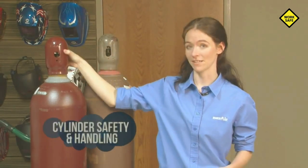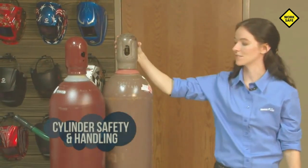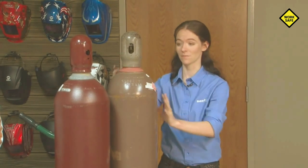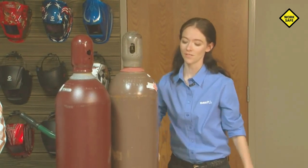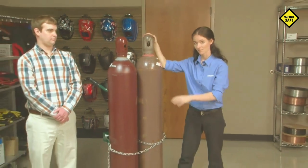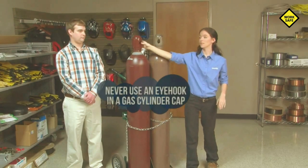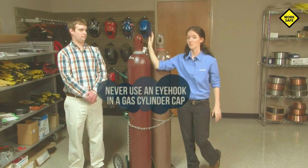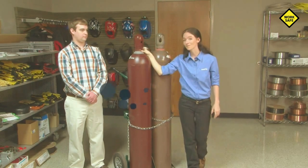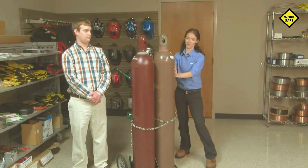For cylinder safety and handling, it's always important to ensure that any caps are tightly fixed onto the cylinders before moving, before handling, and before lifting. When lifting a cylinder, you always focus on either using a belly strap or by leaning it forward and tipping it onto a top. Never use an eye hook in these caps. These are bump caps made for side pressure, not for lifting. The threads will come off and the cylinder will fall, which is never good when you're dealing with this amount of pressure.